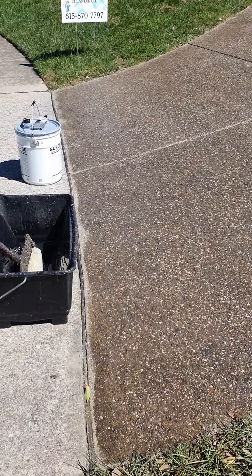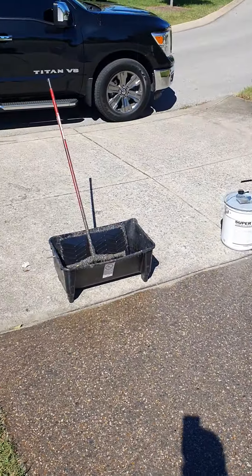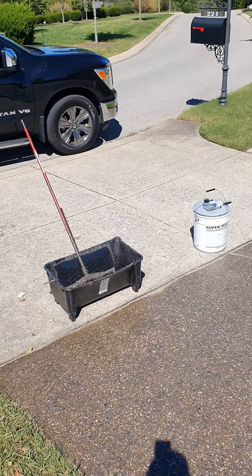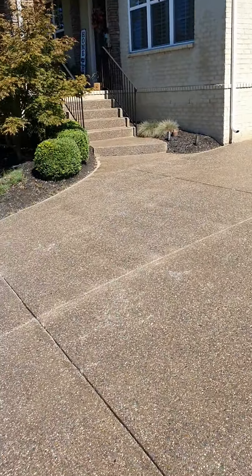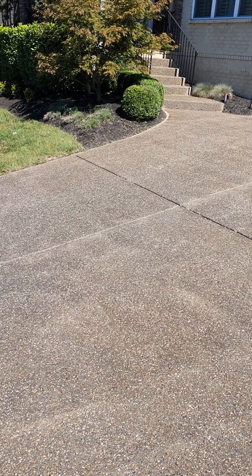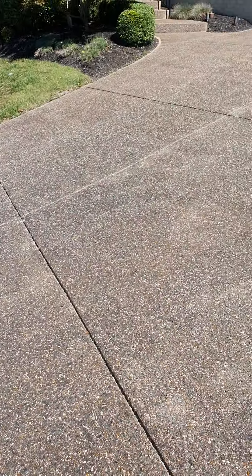The last thing I wanted to point out is edges. On my edges, I really only do that on the second coat. First coat, I'm as good as I can be — you've got the 18-inch roller with a one-and-a-quarter nap. Invest in the good bucket; you buy it one time and use it forever. I used to do the disposable ones and it wasn't worth it — buy the good one, available at Lowe's or Sherwin-Williams. With edges, just get as close as you can. It's a pretty big roller so you can't get everything perfectly, but get as close as you can to the edge. Then go to your local store and get a paintbrush — I usually get a three-inch one — and hit all my edges with that. Do your edges only on the second coat to avoid hitting the same spot three times. Come back the next day, do your edges first, then do your second coat.